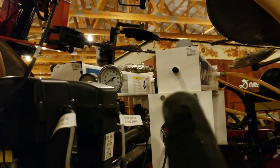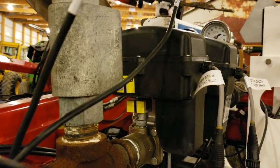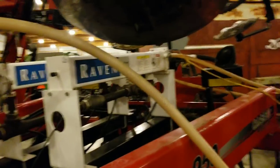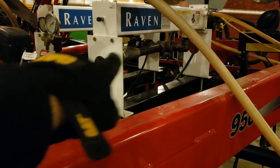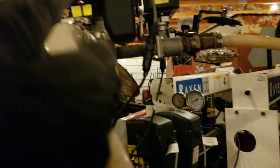It makes it easy to go into our John Deere Link online and look up everything we need for data. To control this you have the Raven super coolers coming in to a valve - you can see the valve calibration number right there, it's a standard valve. Then you have a main central on/off, and we have four shutoffs that go out equal-length hoses to the dividers. The rate controller tells the monitor what to do - you've got a flow meter and a valve, so the amount of flow coming through that meter tells the valve to open up or shut down.